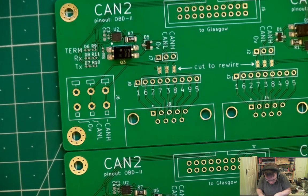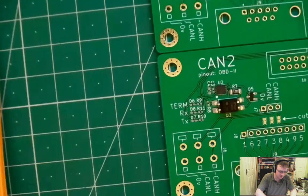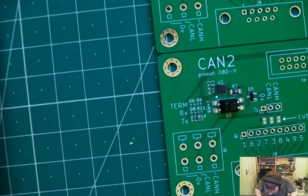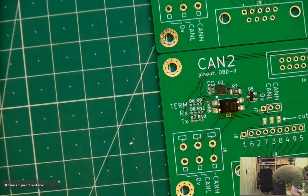Six LEDs out. I might need a loupe to deal with these because they are small. They have a little plastic lens on top and a couple of pads on the bottom. Looking at the datasheet will tell you how to identify the orientation — but you probably won't be able to see it with the naked eye. I thought my loupe was on my desk. Sometimes magnification helps.